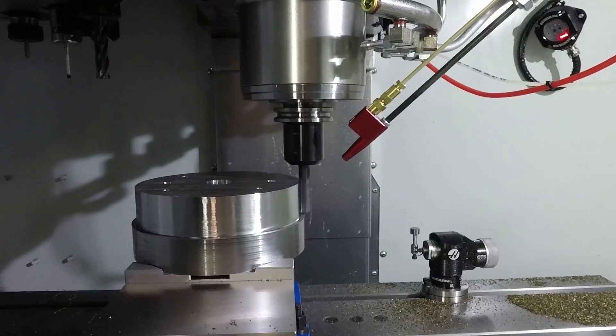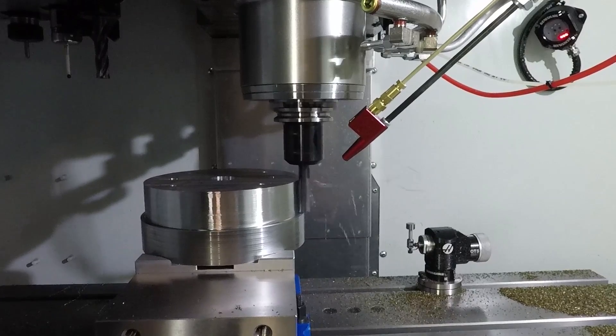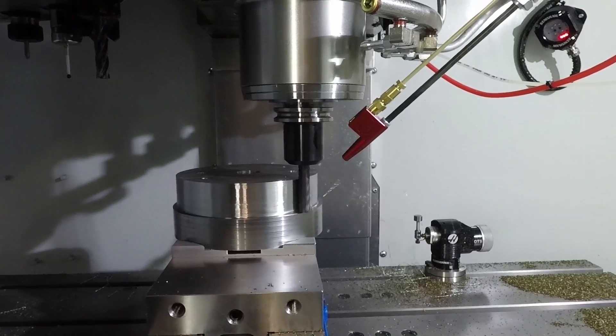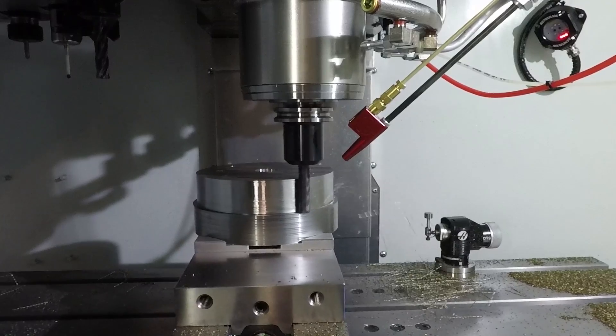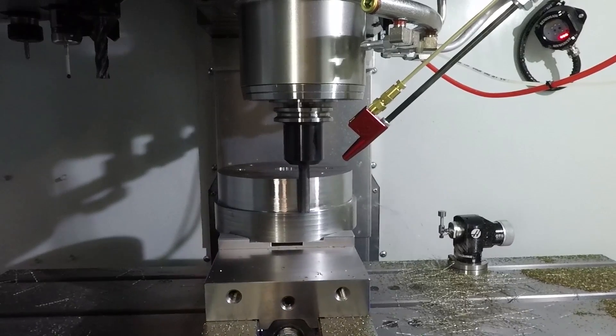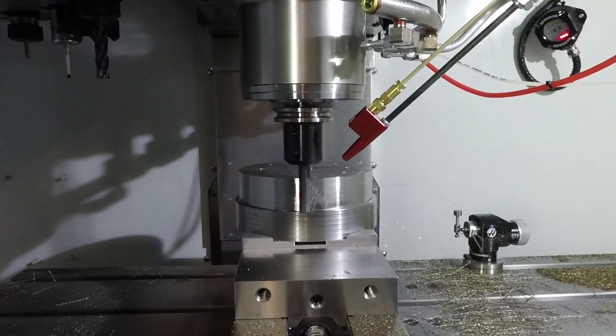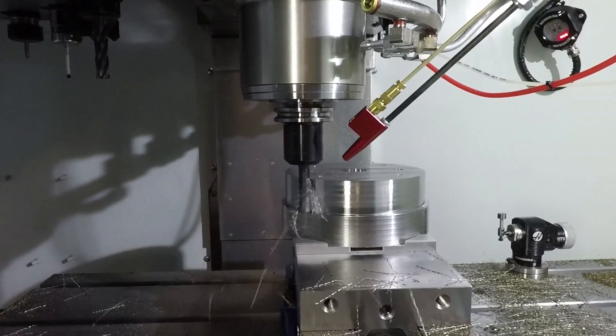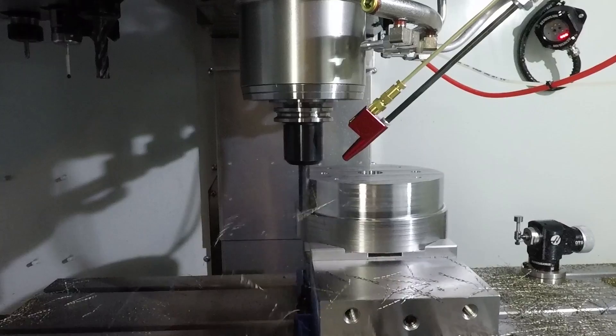Overall, I'm really happy with the performance of my Super Mini Mill 2. I bought it specifically to cut discs that are about seven inches round and do some circular interpolation. Obviously you'd rather have a lathe to cut something like this, but on a very consistent basis we're able to do a circular interpolation on an OD in tool steel to less than a thousandth. I'm super happy with the performance — it runs well, it's accurate, it's consistent.